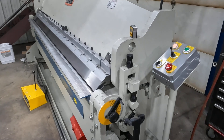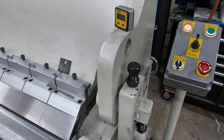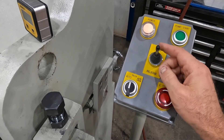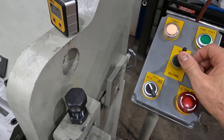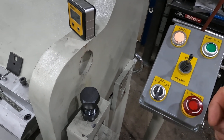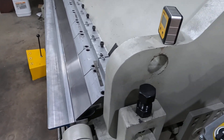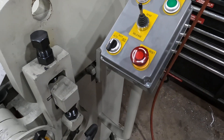If you happen to be looking for something — the six-footers, eight-footers — I think they're all fairly similar controls. So just a walkthrough here: you've got your overall control setup, pump start to engage the pump, e-stop, and then a toggle to bend and a toggle to release. You've got an automatic mode so once you get your bend backstop or gauge stop done you can hit bend one time, it'll rotate up, come back down, and cycle the bend. Inch mode is just to bump it, and as you're doing it you can look down and watch the apron as it comes up. You can also do an auto-to-open which will cycle through back and open.